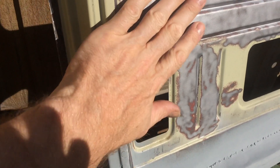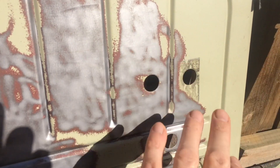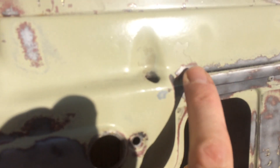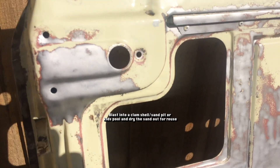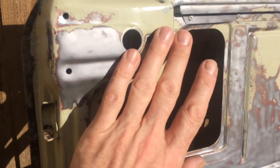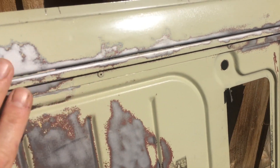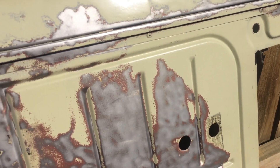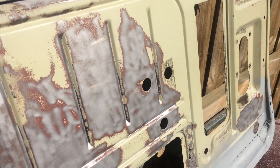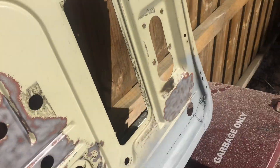So here are the results after a bit of high pressure washing — this is pretty quick, really nice finish. I'll have to rough that up a little bit before I put primer on it, but you can see it works really great. It took the paint off, which was multiple layers of paint, pretty easily. It's really good for getting into these hard to reach areas. It uses a lot of sand — I used about 20 kilograms of sand in about 10 minutes. It's a really nice finish for small components, fantastic, but for large surfaces you might want to just get into the nooks and crannies and difficult parts and then use a normal paint removing wheel or disc to get the rest off.